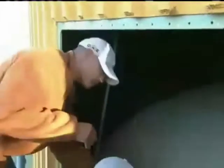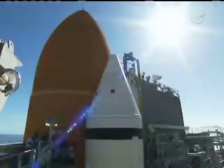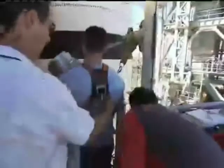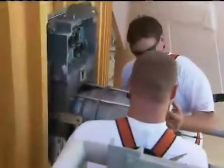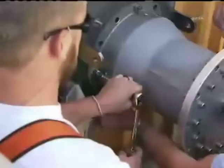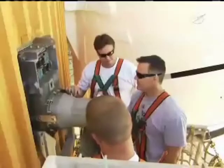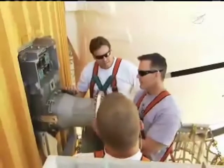And what we're looking at here is the interior of the inner tank area, shown at the very top of the tank there, and this is the quick disconnect you were talking about. Yeah, that's correct. You can see the quick disconnect as it's being mounted there to the carrier plate. That interface, at the very nose of that quick disconnect and where it lands on the seal, is a measurement that we hadn't been controlling before.